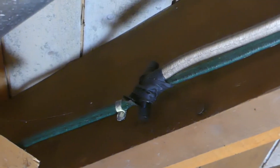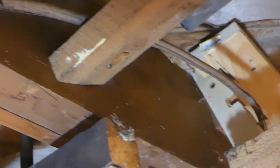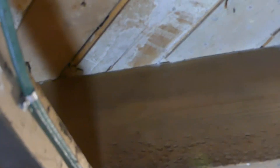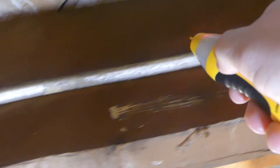And here they just have some marettes and some electrical tape and a splice right in the middle of the line. I expect this here is live. You can see this is the one that fell down on top of me when we were taking the wall apart, and we just have it taped off on the end, because it is split off from this light over here. We'll test it just in case. And it's live.